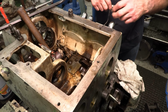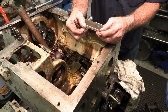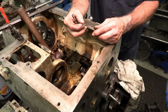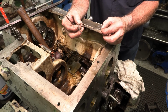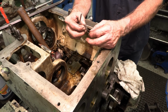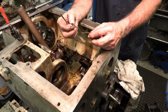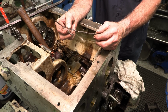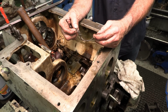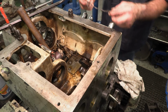Okay, I tried putting my puller shaft, slam hammer, through there, and it couldn't, so I reached in with my scribe. This is like a rope packing, and that's a packing nut on this outside. So the seals for these shafts are actually rope packing, like a stuffing box. And this is coiled in there, which normally packing's not coiled. So this is really old school. So I'm going to save this piece off to the side.